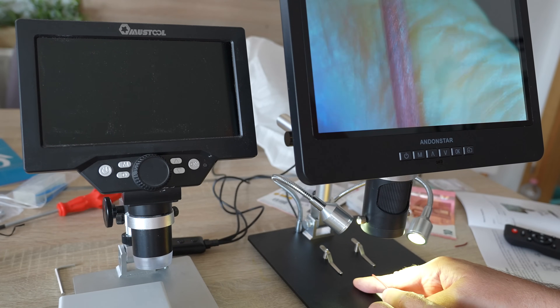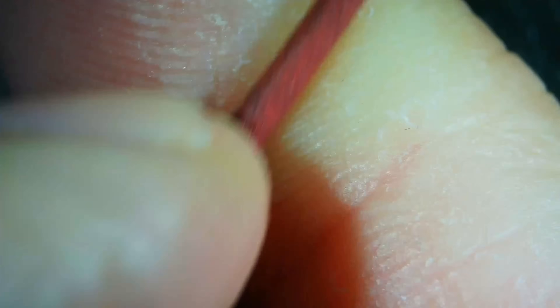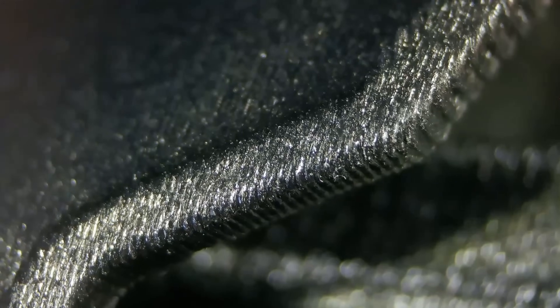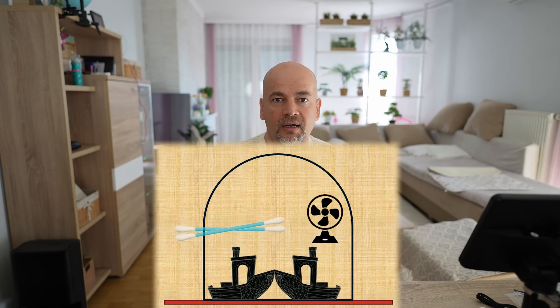In the meantime I'm preparing experiments and I can see two possible risks. I don't really worry about a small number of fiber particles on my skin, but if I touch my eyes or eat food they may cause problems. So far I found similar results by rubbing the filament itself against my skin — especially the end of the filament — and yes, I could see some small fiber particles. But when I tried with a 3D printed object like this benchy, I couldn't see any particles on my skin even at different strengths and angles — it looks like the fibers are melted into the plastic. The second concern is whether inhaled particles are flying in the air. To test this I'll create a closed volume, rub two similar fiber-reinforced materials together, use fans to circulate the air, place air cleaners inside, and analyze whether I find any particles.